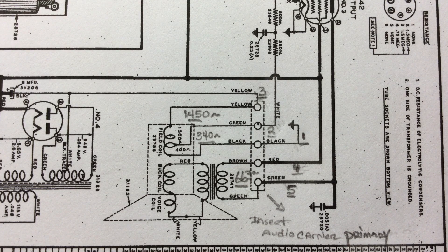Anytime you do one of these, DC resistance can at times be misleading. You put the radio under load, apply the high voltage, and new problems can creep up. But I wanted to share this and tie the schematic back to the testing I just demonstrated. Hopefully this has been helpful for beginners — folks that have been doing this for a long time probably get no added value from it. Thanks for watching.